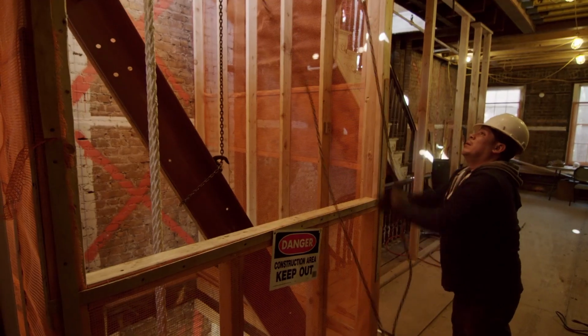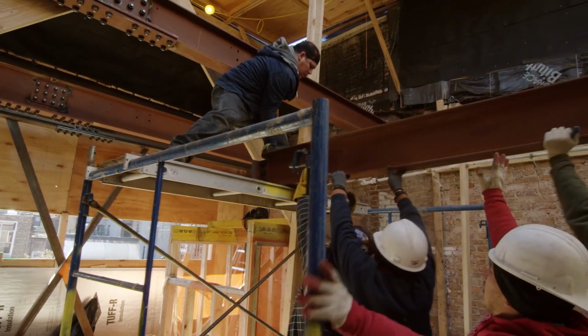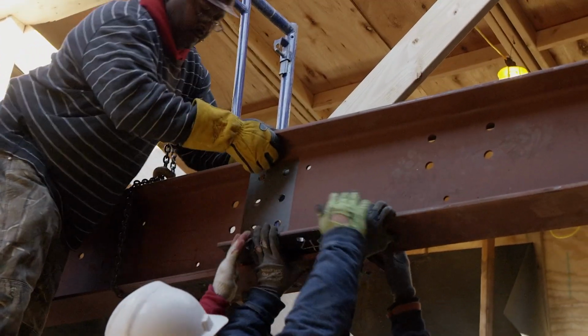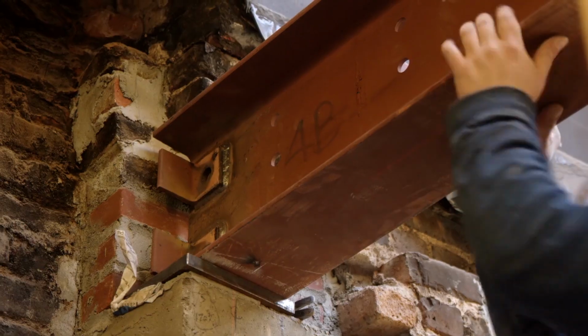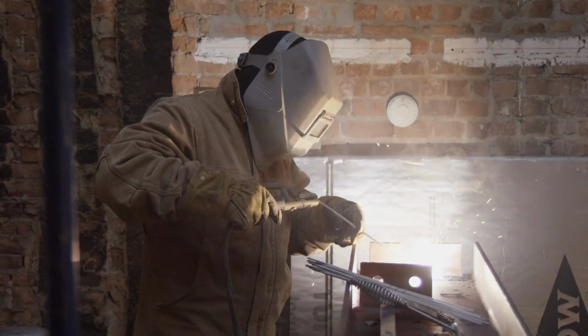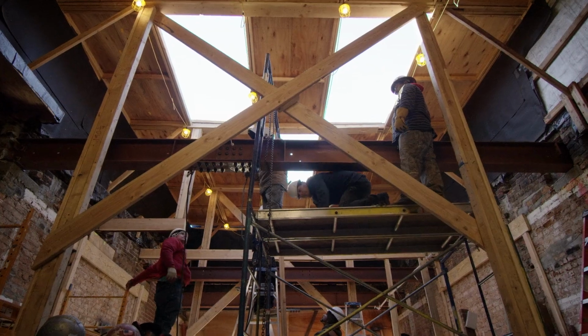Before you demolish, you have to shore up the existing party walls. And so there was a sophisticated system of bracing put in. And then there's a sequence in which you demolish portions, put steel in, move your shoring, demolish another area, add the steel. And so it was a step-by-step process involving many trades, putting back the structure of this house.